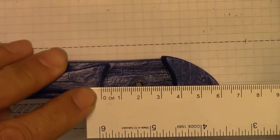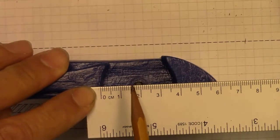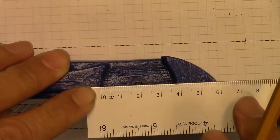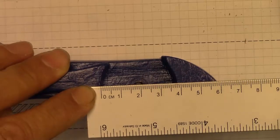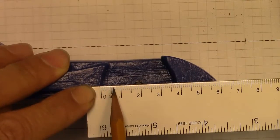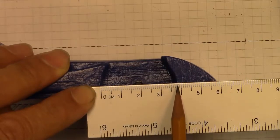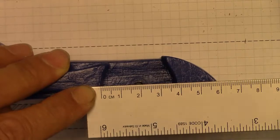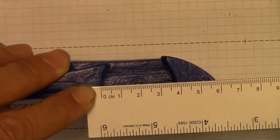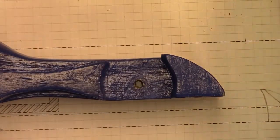so watch this, and I'm going to put my ruler kind of on center of that circle. You can see it's kind of a half circle. This student here missed their mark by about a millimeter and some change, which could be an issue on race day. So if I start here, that's 0, 10, 20, 30, 35, 36, 37. Their wheel well, this spacing here is about 38. So they're about 2 millimeters shy of what I would consider specs, 40 millimeters. Now, give or take a millimeter, right? So what does that mean?